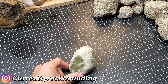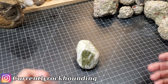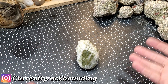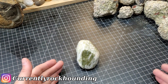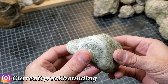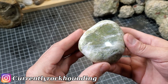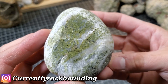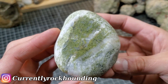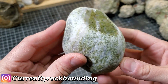We are all done with that. The High-Tech flat lap does not come with that 80 grit pad — you'll have to order it separately. But it is so, so worth it; I wish it came with the 80 grit. You can see here how flat we made that — dead flat. And you can now see that epidote. See that polish? Came out beautifully. You could definitely find other river rocks with a flat enough face to do the same thing.